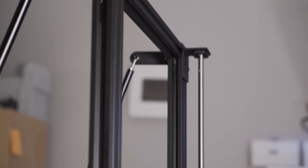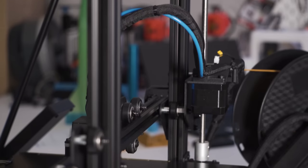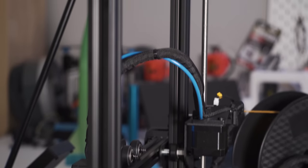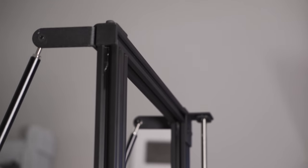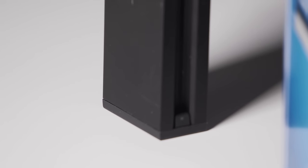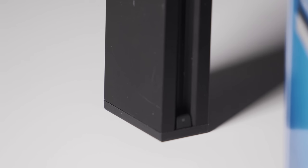On the backside of the printer, there is a single lead screw for the Z axis. Most of the higher end printers have dual Z axis lead screws and motors — it would be nice if it had that. It does help keep the X axis nice and parallel to the bed. Another thing that stood out is the feet on these — I don't know if they're even rubber at all. It's been proven that a good set of rubber feet goes a long way in reducing vibration on a 3D printer, and these feet really don't pass the test. They really could just throw some thicker rubber feet on all four legs instead of these, which don't do much to absorb any vibration.